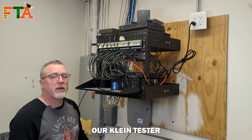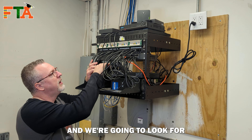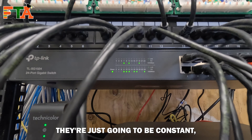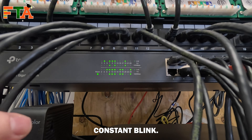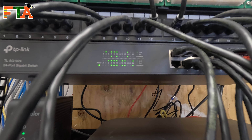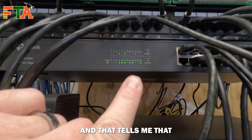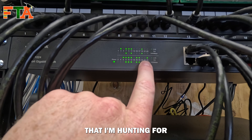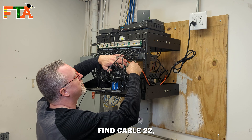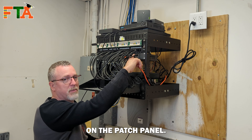We'll go take a look at the switch and see what that looks like. With our tester sending the hub signal, we look at the switch for any ports blinking a different pattern. Most ports are going to blink a constant, steady pattern. In this case I can see that port 22 is going off and then back on with specific little blink patterns. That tells me my cable is on port 22. Then I just find cable 22 on the switch, trace it out physically, and in this case it goes to port 22 on the patch panel.